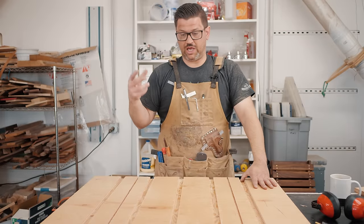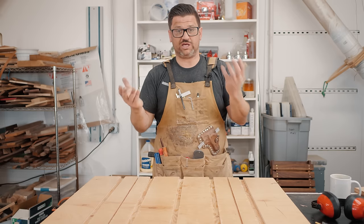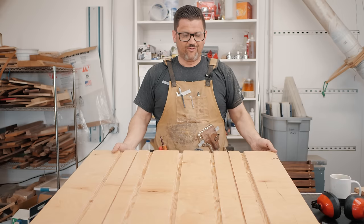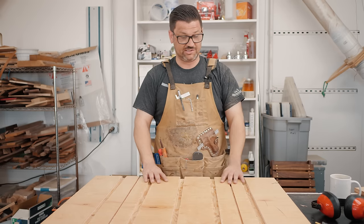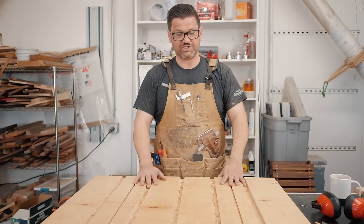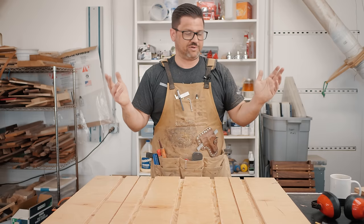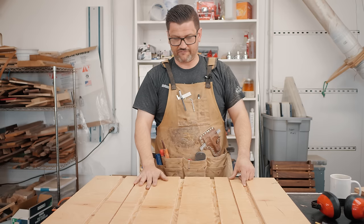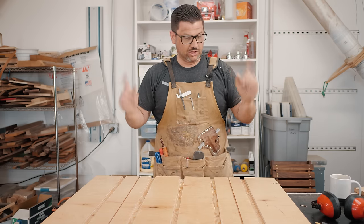So now we're going to build a torsion box-like frame underneath — just something very simple that keeps it flat. A big piece of plywood like this usually is twisted a little bit. Also, when you're cutting veneered plywood, make sure to tape your cut. There's tons of chip-out on these dados — I should have taped those. Luckily this is just shop furniture, but we don't hide our mistakes on this channel. It's not going to affect functionality, so I'm going to let it go.